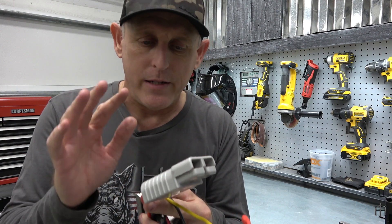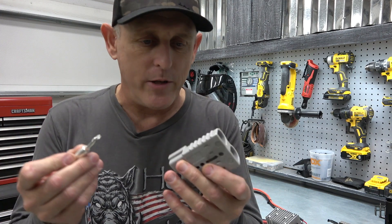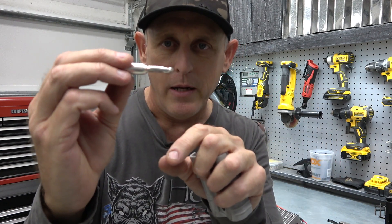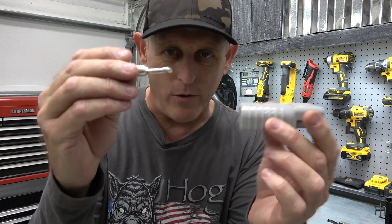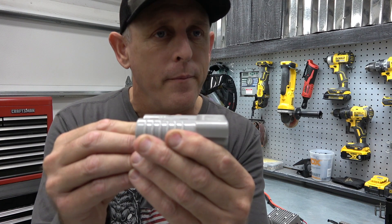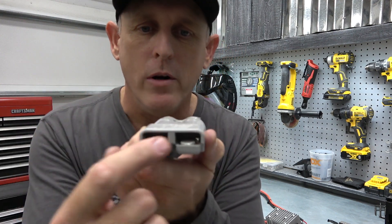Let me show you a little bit about this quick connect plug that may make it easier if you've never built one yourself. When you order one off Amazon you'll get two lugs with it. The lugs have a little lip on the end that slides into the plug and catches on a flat piece of metal inside. You put the flange down and slide it in — you're going to hear two snaps. The first snap is not what we're looking for; it's the second snap that locks it in.